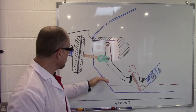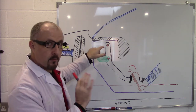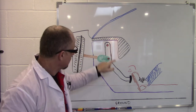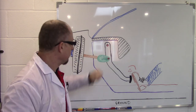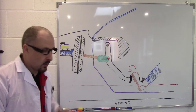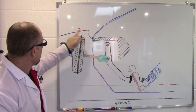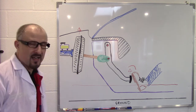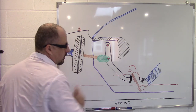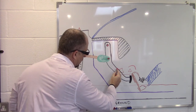You can't actually raise the entire brake assembly up, because you'll find in most cars the pivot of the brake pedal is almost all the way up deep inside the dashboard anyway. So this top pivot can't go any higher. Also, if you push the whole assembly up, then the servo ends up getting pushed too high, which is going to mess with your bonnet line and your styling. So the only alternative is to cut the bottom of the pedal off and shorten the pedal.